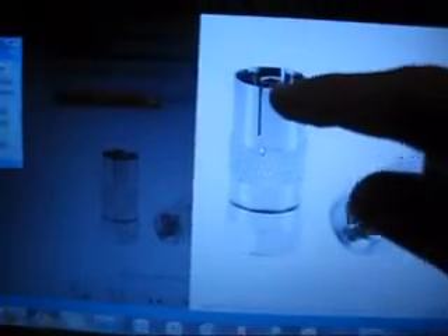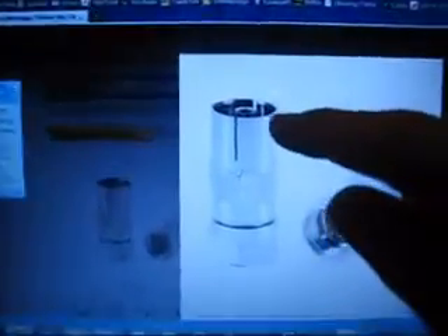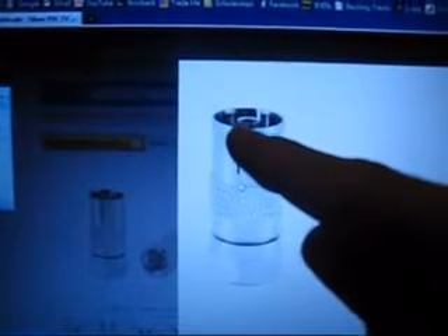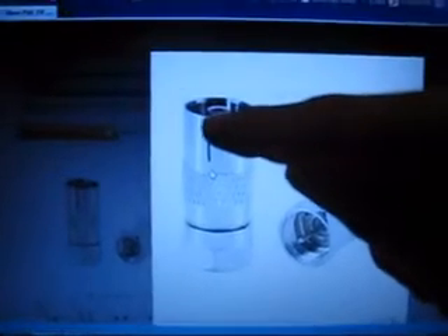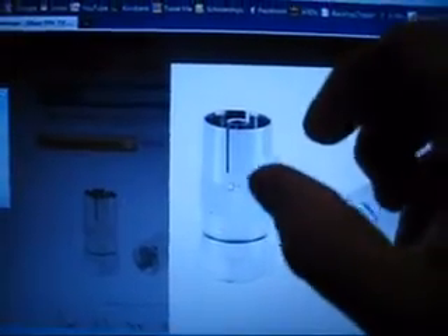The commutator here was basically one of these — one of these PAL TV aerial plugs. As you can see there's a cut there which acted as one of the splits in my commutator. So I bought one of these, gold plated — great for electrical current transfer. And basically I had to make three cuts. Well, as you can see there was a cut on the other side anyway, so I actually needed two of them. But I needed to create three 120-degree sections of this actual plug here.